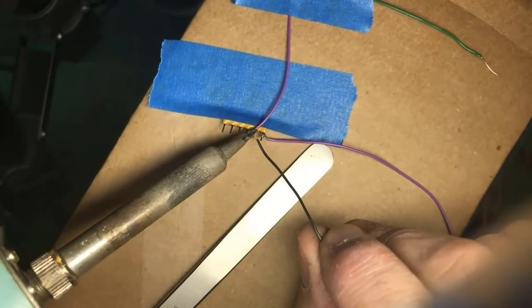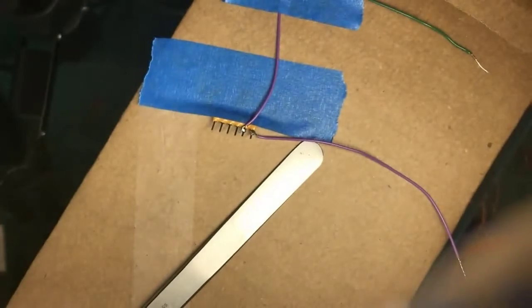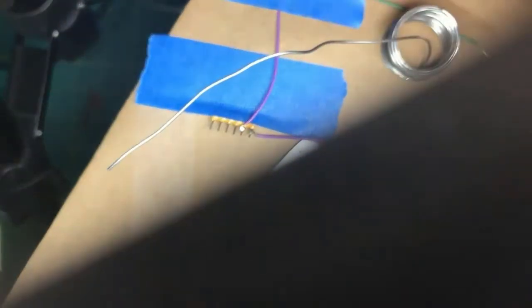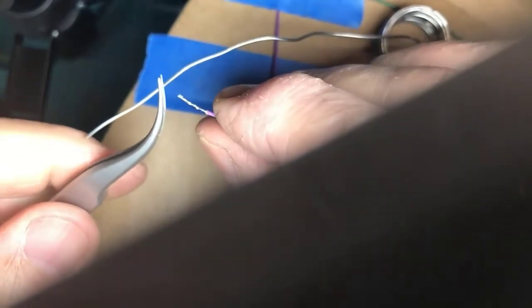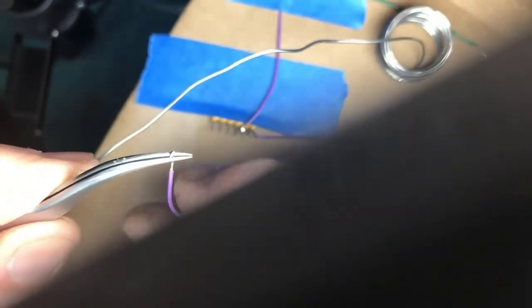This is where I could actually take this tip off and go to one of those really fine tips that I have, so it's easier to get in there and make the connection. So this is where taking the time to switch over pays off. Now, maybe what you have is two different soldering irons, one with a large tip and one with a small tip. That works. Maybe you don't have the fancy round nose pliers, and instead you get your fine tweezers and bend up your wire